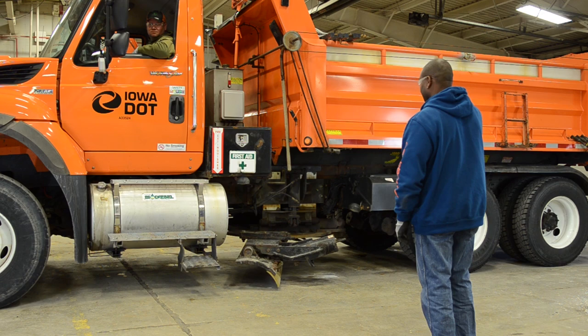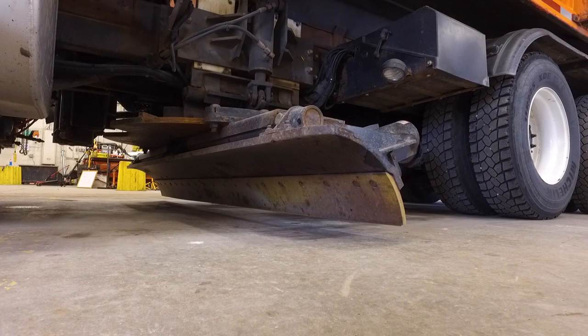After setting the angle, be sure you put the locks in place. Setting the blade tilt or curl is critical when you are ice blading because you always want the sharpest edge in contact with the road surface.